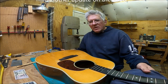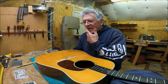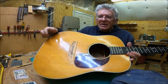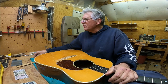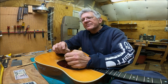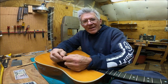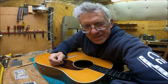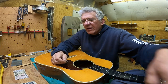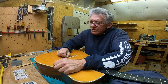We're back with this D-28 and I've already skipped ahead. Here's the finished scar — I pulled the tape off of it. The way I like to smooth this out is using one of these razor blades: a utility razor blade that I break, put into a vise, grab a pair of pliers and snap them, and come up with little pieces that are really handy for scrapers. Just come across like that and scrape it.